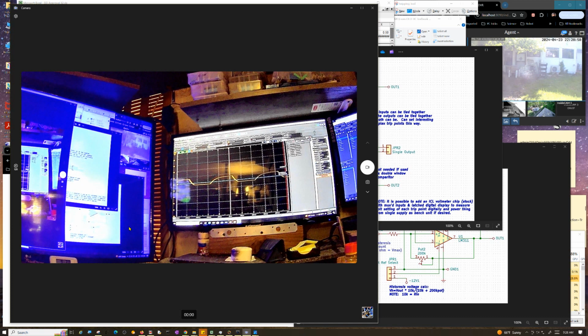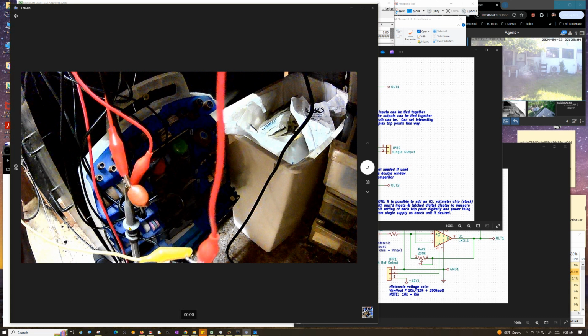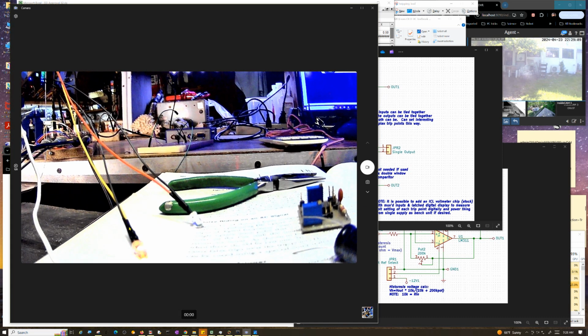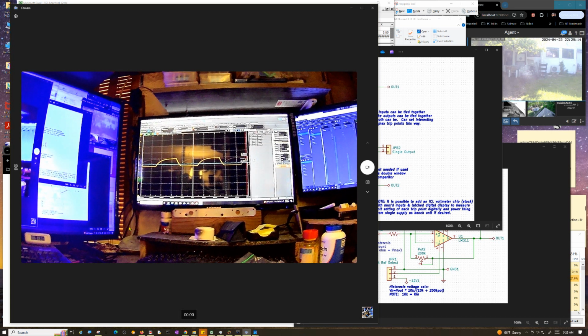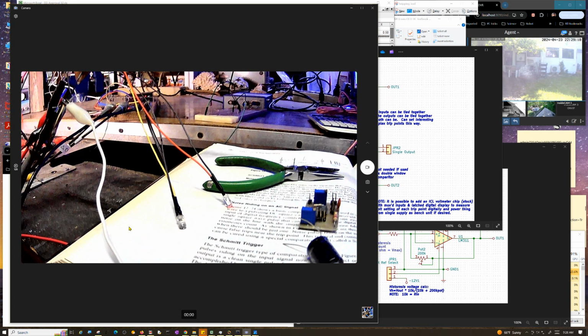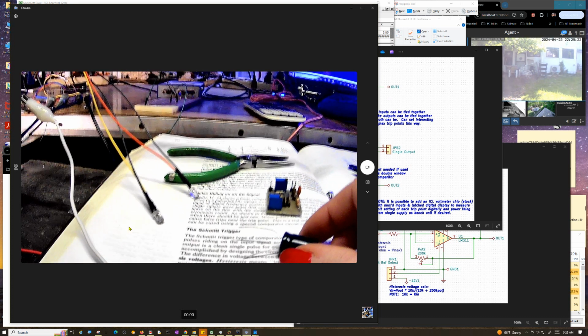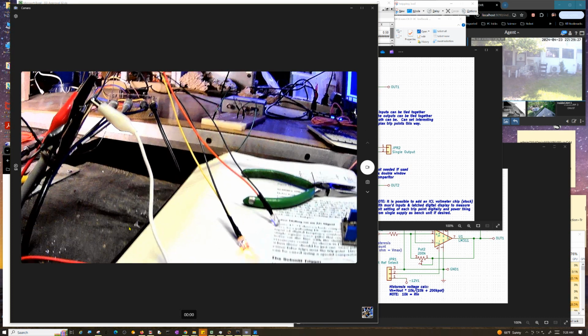At any rate, it's hard to get the frequency down because this capacitor is relatively large. The signal starts really diminishing as I lower the frequency, because it's making a filter, since those two resistors are like 10K each. So it's an RC filter. Anyway, when I had this capacitor in there, I was trying to adjust the DC level down, but I turned the signal source down to 0.